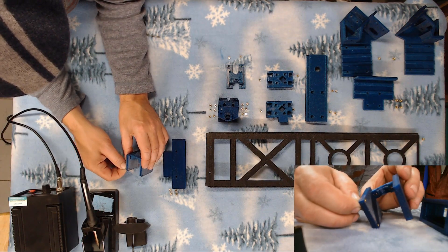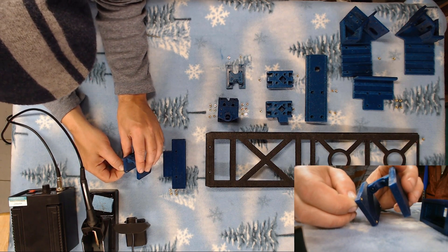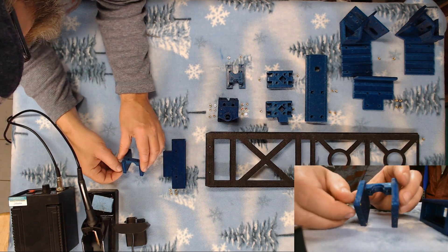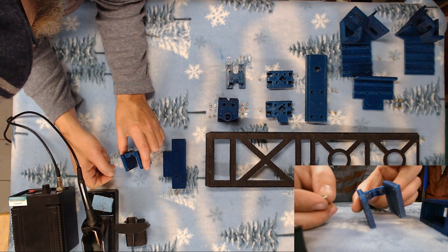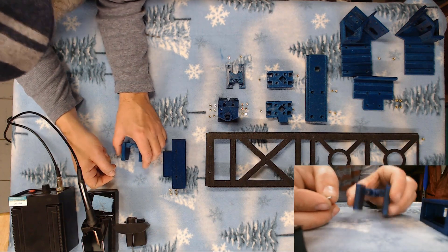Make sure when you put them in it doesn't take much heat to get them going. I usually stop just shallow and then give them a tug with the bolt so they go in just below flush. And that takes care of the six metric M2 heat sets in our hot end mount and fan mount.